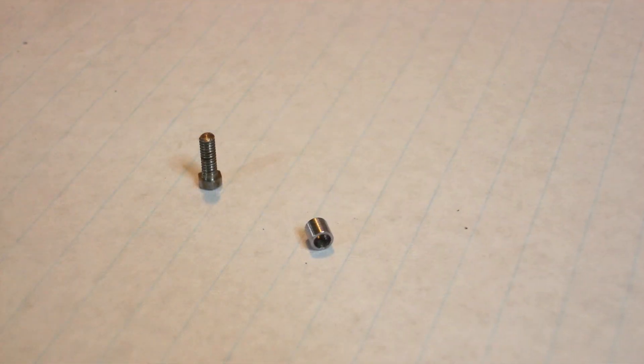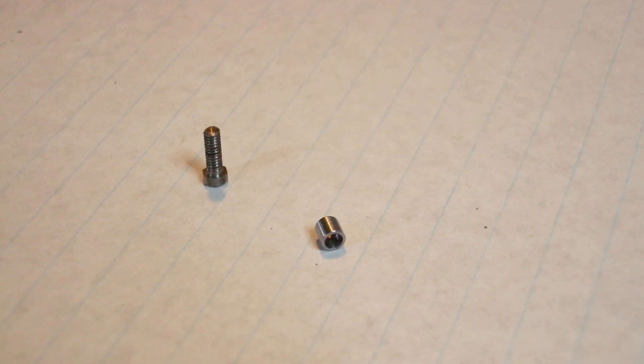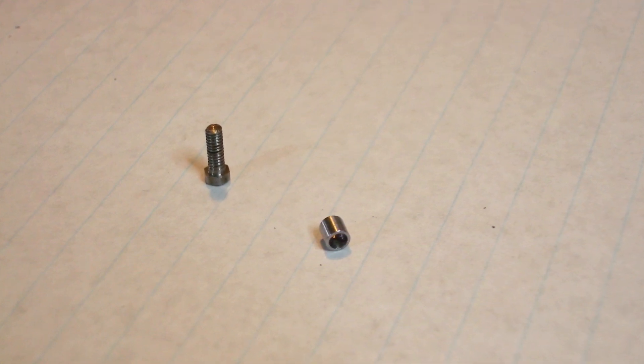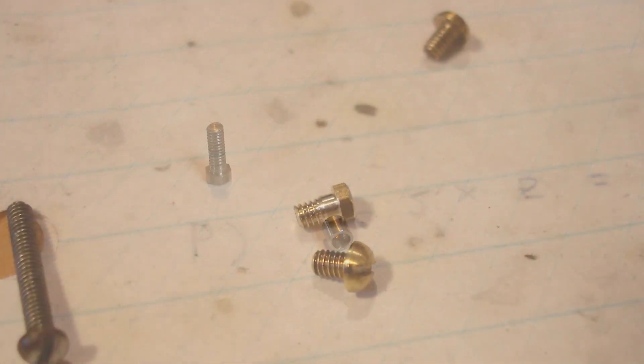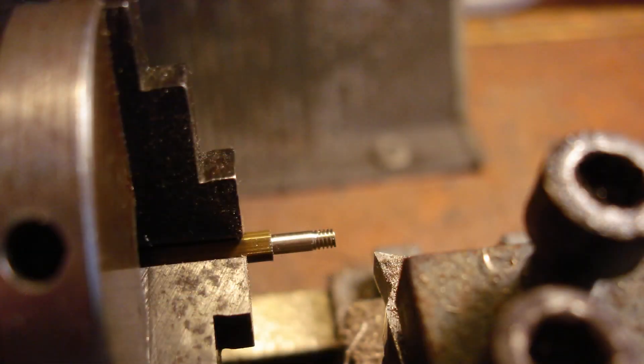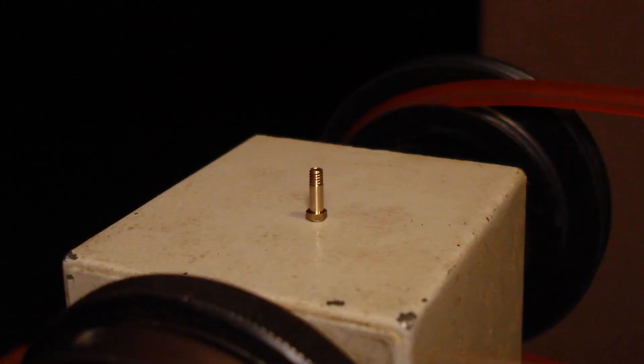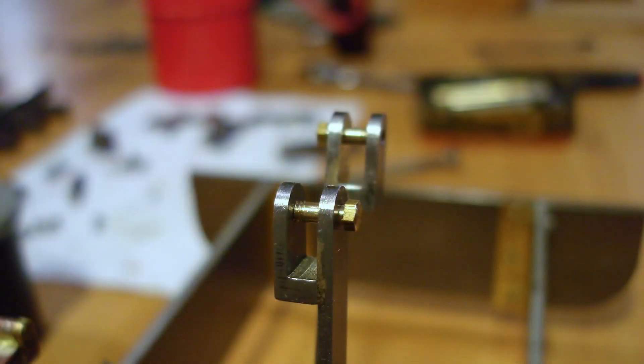The die block is a piece of 1/8 silver steel — turn down a couple of thou and drill through for the 8BA screw that attaches it to the extension rod. The new expansion link hanger bolt replaces the screw previously used. Making longer bolts for the forks on the eccentric straps. The bolt is in position, ready for the expansion link.